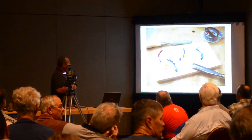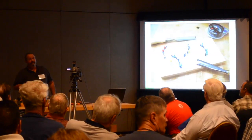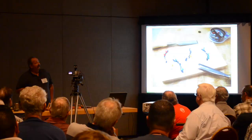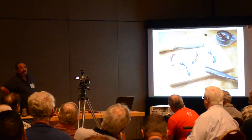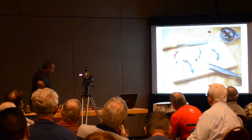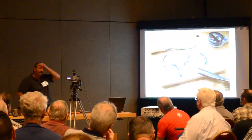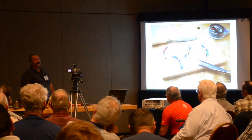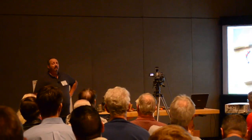Is this 1/16th inch? Yes it is. I've tried to do this with an exacto knife and store-bought veneers - that's really thin and I cannot get the points; they always break off because of the short grain. It could be the grain, it could be that you need to look for something with a tighter grain as opposed to a wide grain like early maple - the points break off. And some of those points are gone too, not only from the grain but also from the charring we've done with sand shading, because it weakens that wood. So if you need 16 pieces to make your fans, make 17, 20, or 22 - when one breaks off, toss it and go again. Thicker wood is going to help hold together more.